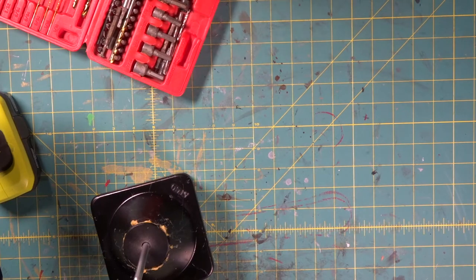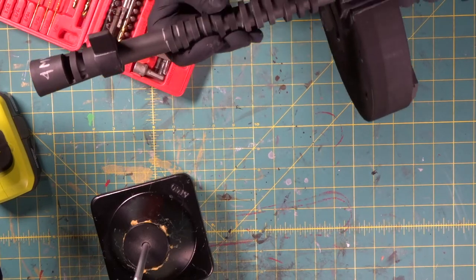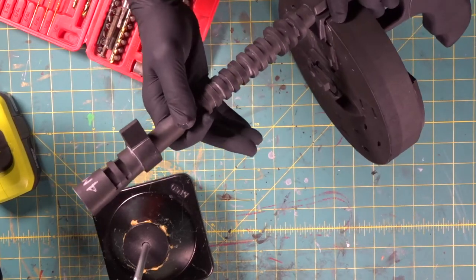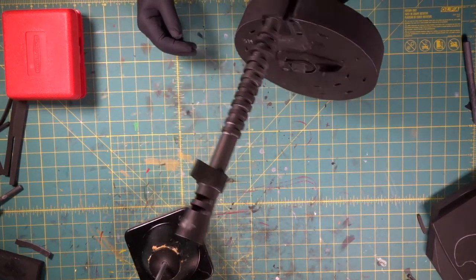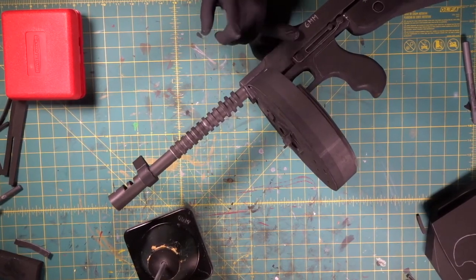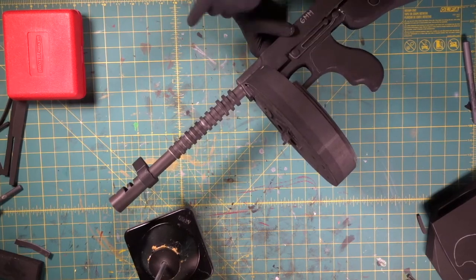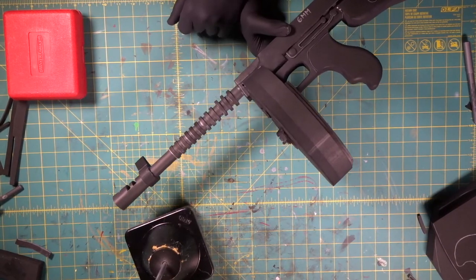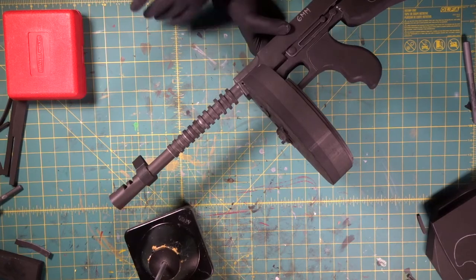We coat our dowel with cement. What we did is put wet cement in here — we didn't wait for any cement to dry. This is the wet cement technique where you get the dowel wet and you spin it around as you're going in and it coats the inside of the cavity. After a few minutes, the moisture content inside the contact cement is going to evaporate and the two pieces of cement are going to stick together.